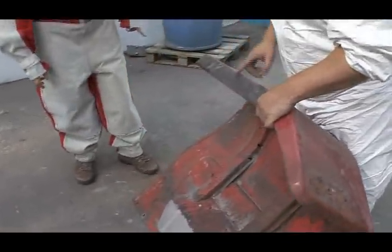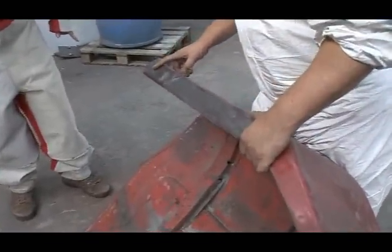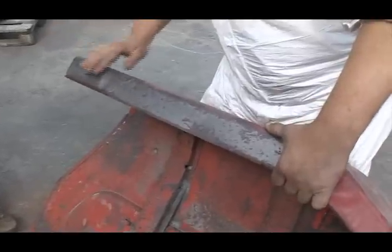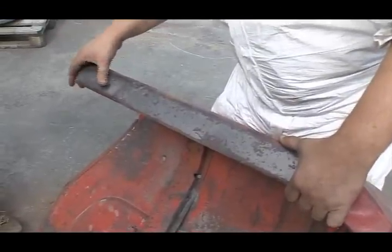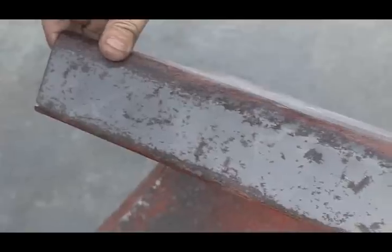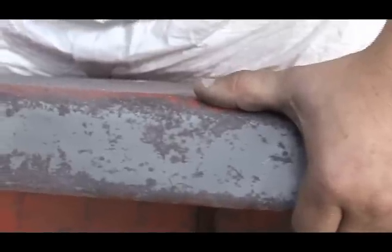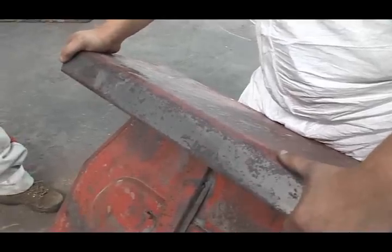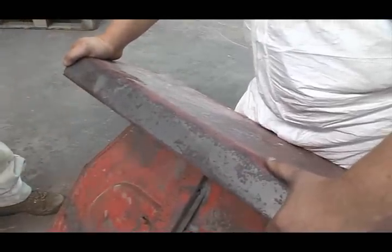Emma Louise, this here is the soda blasting we've done in this mudguard. The reason again why we've done this is basically to gently remove the paint and expose the underlying surface. And this here hasn't caused any distortion on the mudguard whatsoever. But there's no doubt the soda is far gentler at 30 psi of pressure, so it's exposed underlying corrosion into the metal. But we'll now take this back in again and do some aluminium oxide blasting to gently remove this oxidisation on the surface of the metal.